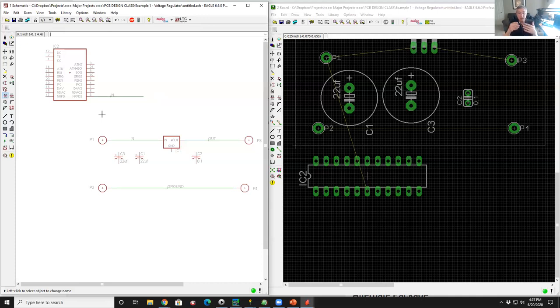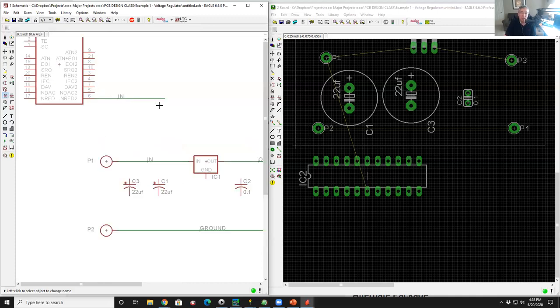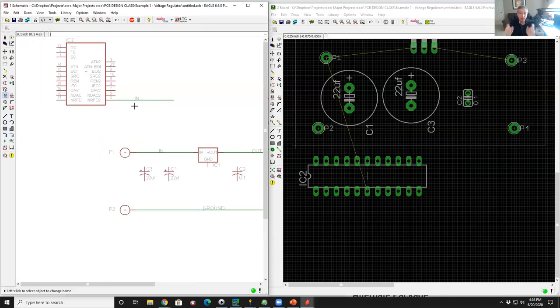It's easier to draw a schematic where all the connectivity is represented by lines on the schematic, like good drafting practice. The problem is that a lot of modern circuits have potentially hundreds of connections. And if you actually drew a connection wire between every one of those pins on the schematic, it would be impossible to read it. So one of the techniques that's used is you'll often see two nets on the schematic with the same name, and the designer knows that means they're connected together.